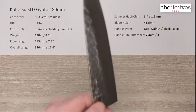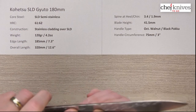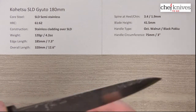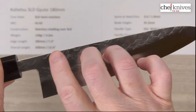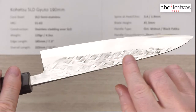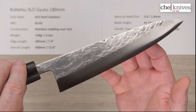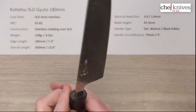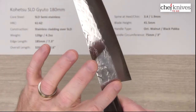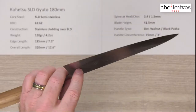It's got a fair amount of stiffness to it, a nice 50/50 grind, thin at the edge, and nice fit and finish overall. They've put in an embossed kanji — not chiseled but nicely done, you can feel it slightly. There's some nice rounding and finish work on the choil, the curve into the neck, and also on the spine, so it's very comfortable.